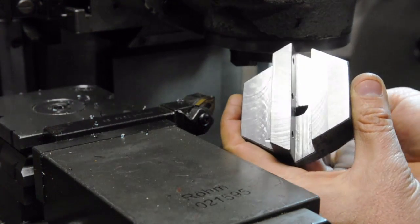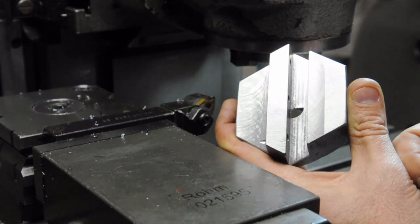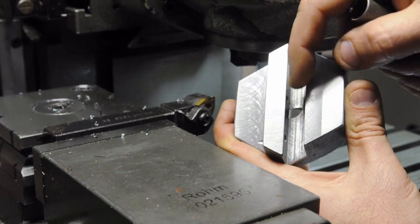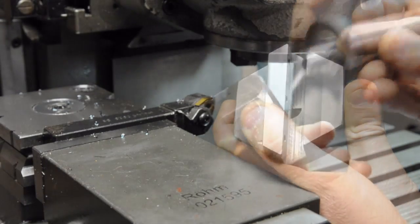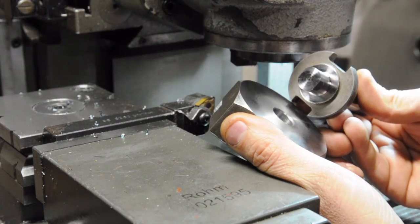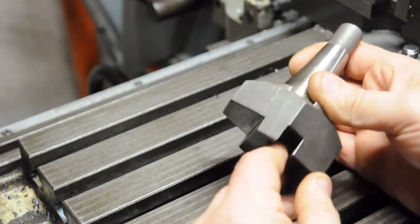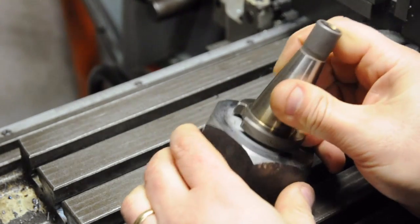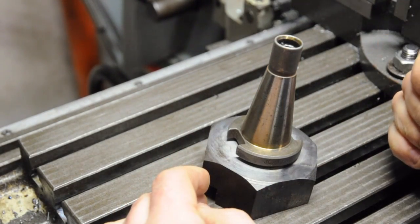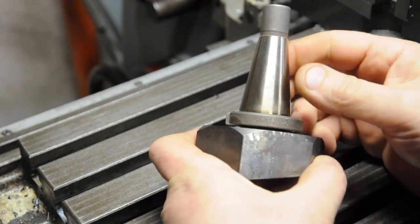The bore on the backside did break slightly through the slot for the high speed steel. I might just open that up a little bit and weld it from the bottom - not enough to fit in the hole, but not enough to give me the warm fuzzies either. No sooner did I reach the press and I realized I had a 10-degree bottom, which makes pressing it a little complicated. So I hit the head with the torch and this dropped right in.